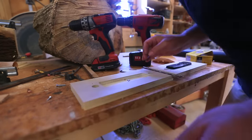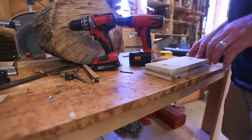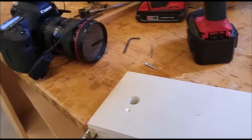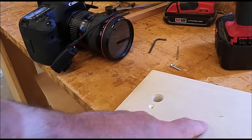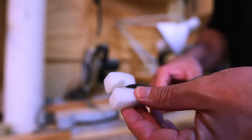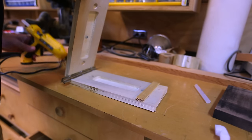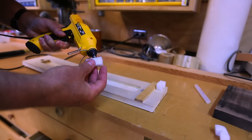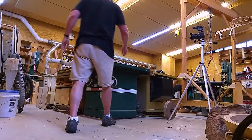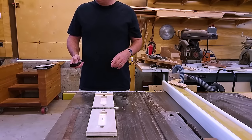To actually push the button on the remote, I put a screw on the opposite side that falls right on the button, so as you push the top piece of plywood it pushes the trigger button. I added a stop — a piece of wood on the bottom half — to keep the screw from pushing too hard on the button, otherwise I'd break it with my foot. The little spring in the button was being used to hold up the entire top half of plywood, so I added two pieces of foam as springs to hold the top piece up, so the button is only pressed when you apply force with your foot and the spring doesn't have to lift that top piece back up.